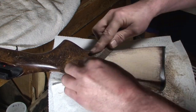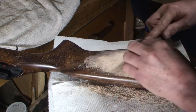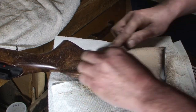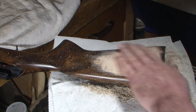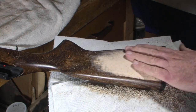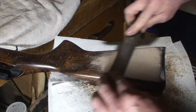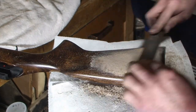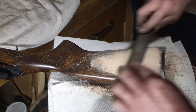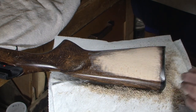All I'm doing is shooting the breeze. I think I'm about ready to check this area with my straight edge. I'm going to smooth that up just a little bit — I'm going in the same direction, not trying to get the rasp marks out for the next step; I'm just smoothing it down so I get a better view with my straight edge.